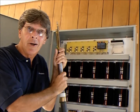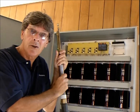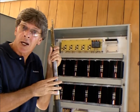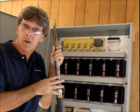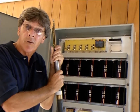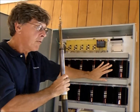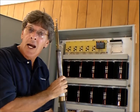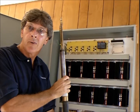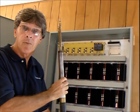I mean, the soils in the Los Angeles, San Francisco, and downtown Seattle area are very silty and applicable for this technology. So there's large areas of the western United States where this technology is directly applicable to retrofit and stabilize systems. So a system like this is basically very cheap, and doesn't consume any energy except when the earthquake's there. And then it's just powered off and waiting for the next earthquake, and it'll be re-energized to stabilize the structure.